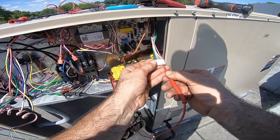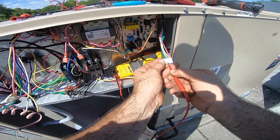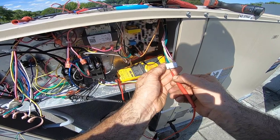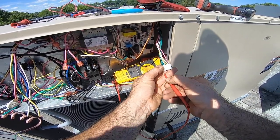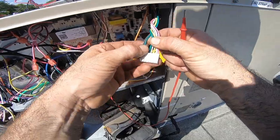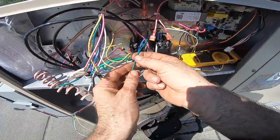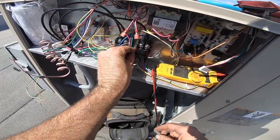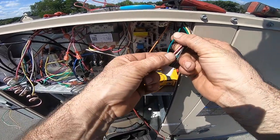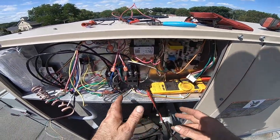Ground, nothing. White to ground. Yellow to ground, shorted. Gray. Green, open. That green shorted. And open. So this one, B35. I think that's my blower contact. Let's see, B35, what is this? Okay, that's my blower. That one's not shorted. The other one has no labeling, oh, it does. K3A. Okay, that's a common, most likely, even though mostly grays are.